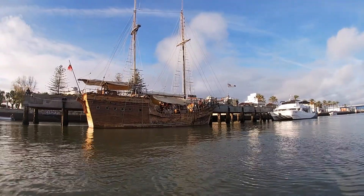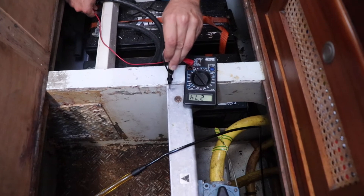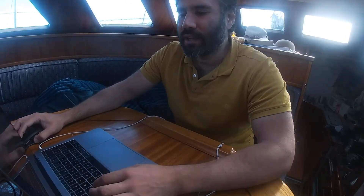There are basically three ways to check whether we have an energy leak. One is to measure the voltage difference between the hull and the battery plus and battery minus. We can also measure the ohms between the battery plus, battery minus, and the hull. And we can also check if we can light a light bulb by connecting the battery plus to the hull with a light in between, and see if the light lights up.